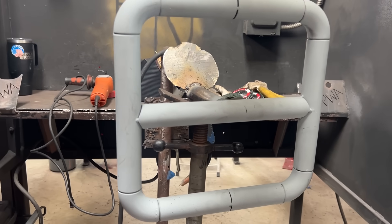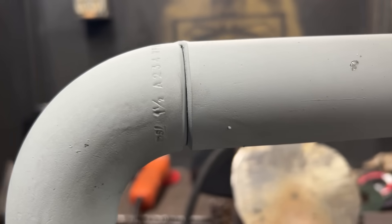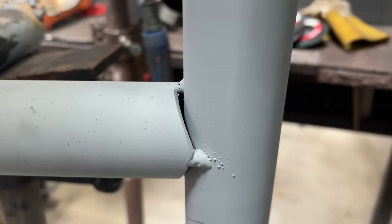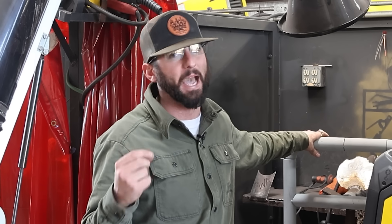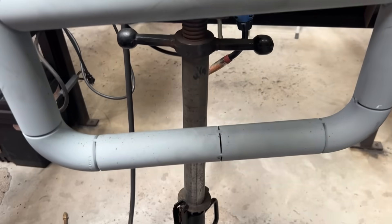This is our handrail coupon — a jig I designed that has all different types of handrail fit-up: where 90s come together, butt welds with bevels, fish mouth joints, saddle joints — all going to be welded. And of course it wouldn't be handrail work if we didn't have a little bit of a bad gap here and there on some butt welds. We've got it completely covered in cold galv paint, so we need to get rid of that before we move on.